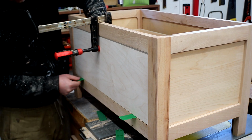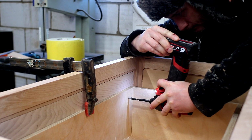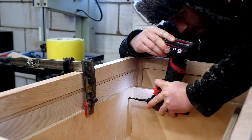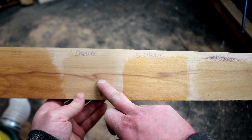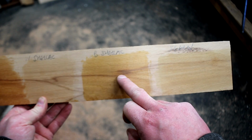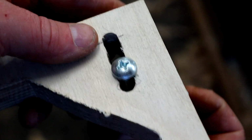As this was quite a big project, I'm going to split this into 2 project videos. The next one will follow, and as soon as it's ready you'll find a link in the description box below this video. In part 2 I'll be making a top for the table, choosing a stain and finish in an attempt to match some other furniture, and making some tabletop mounts to allow for expansion and contraction of the wooden top.